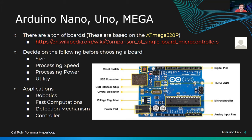More parts: we have the reset switch — some Arduinos, mainly knockoffs, do not come with one, so you may have to build your own. It's really important because sometimes your Arduino code goes out of sync and you just hit that thing to give it a restart. You also have a USB connector and a USB interface chip — important because you need a way to flash the EEPROM on your Arduino with new memory to program the board. The crystal oscillator — it's pretty much a clock, oscillating at about 16 MHz in most Arduinos. Based on those square wave oscillations, you can control the signal inside your Arduino.